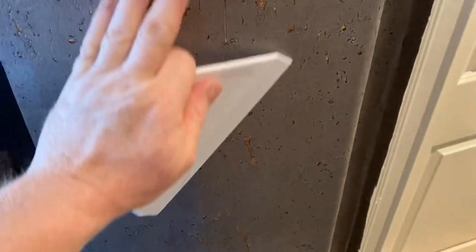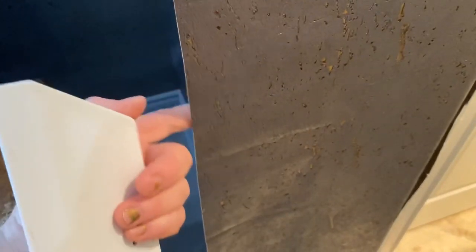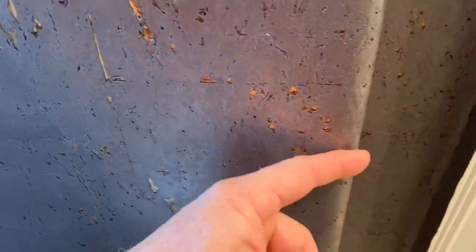This is a potential for a lot of liability with it coming up and having a terrible installation. We glued the back of the cork. Then we put extreme tack in here, but over here, I put liquid nails, okay? It's not going to change the color of your wall covering. It's going to hold on to that just like nails. Okay, that's how you do that.